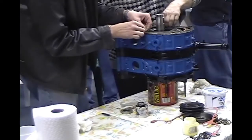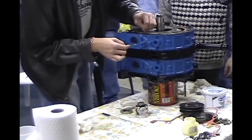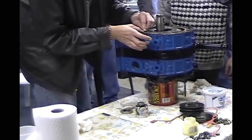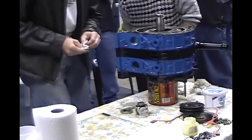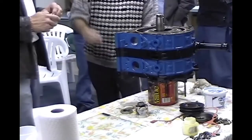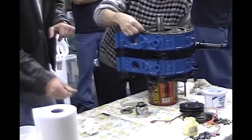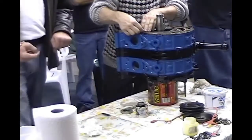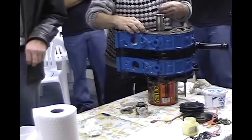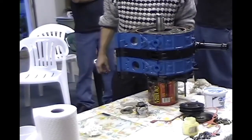Pushing down into it. Let the housing push them down. They blow up, you still got one. Huh? Probably after an hour. You gotta make sure there's not a spring stuck between those. The spring stuck between where? The apex. You look at spring cross, they look a little weird just here. There's new corner pieces with 74 springs.